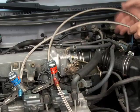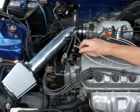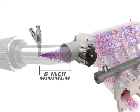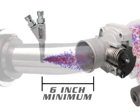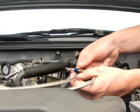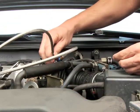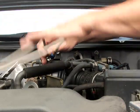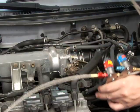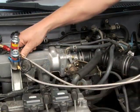Place the temporary plumbing assembly under the hood and look around for the best point to introduce the soft-plume nozzle. For a single wet fogger kit, the nozzle needs to install in the intake duct between the air cleaner assembly and the throttle body unit where the throttle lever exists. While you decide on an entry point, consider that the nozzle and its hoses will most likely need to be inserted sideways rather than straight down because of hood clearance issues if the hoses were sticking up. At the same time you're deciding on nozzle placement, figure out the best mounting positions for your solenoids.